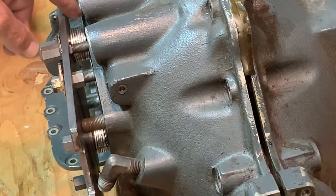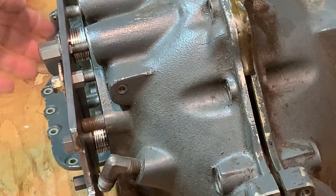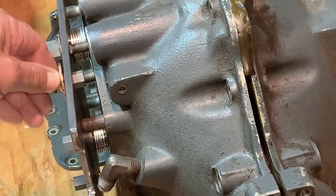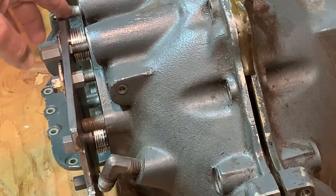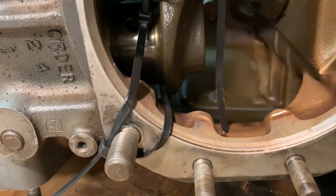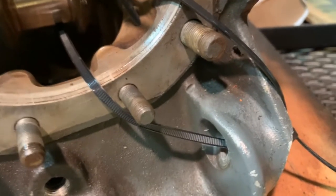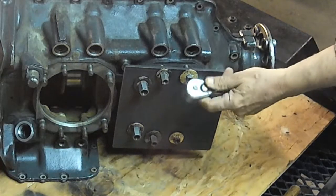With a short plate like this it's important to get some padding washers in there to start off with on the large bolts, then let the pressure build here slowly, and then on the other side as well, and then those can be removed as required. I also made sure to first tie off the crankshaft to that bolt, just as I had done over here — I tied the rear part of the crankshaft to the engine mount. So now we're set up with the left plate and the right plate.